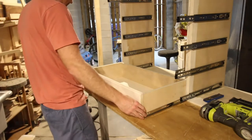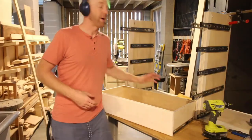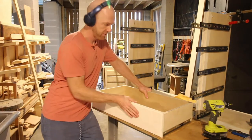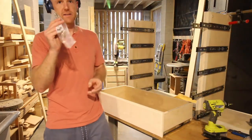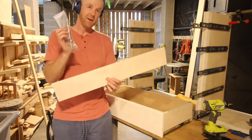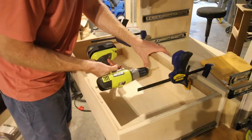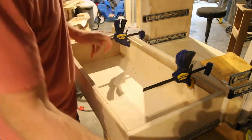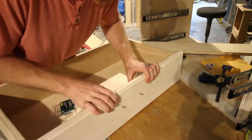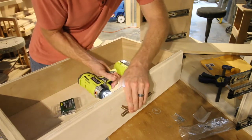With the slides in place, we attached the drawer fronts just using nails. I didn't use glue because we're going to be screwing them in using the handles. I made a little jig measured to the inside with holes exactly the size of our hardware. I slide the jig in, drill from the back, and attach the hardware no problem. The jig was clamped in place and we drilled the two holes through, then pushed the machine screws through the wood and attached the handle on the outside. This holds the drawer front in fully securely using the screws and the handle as leverage.